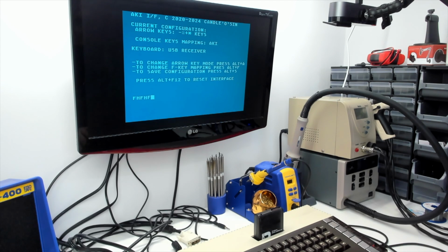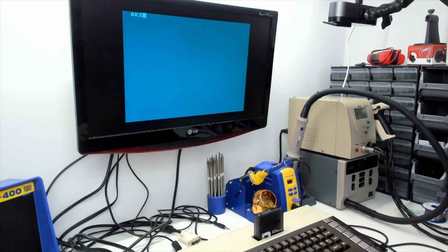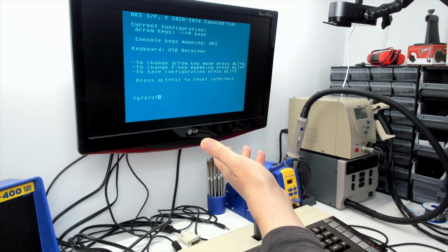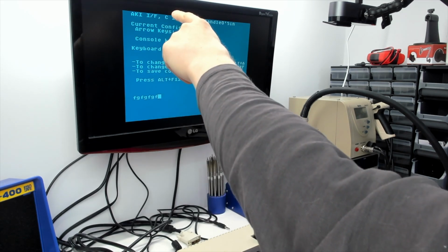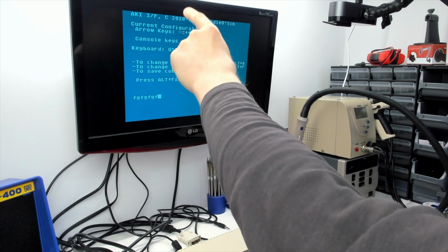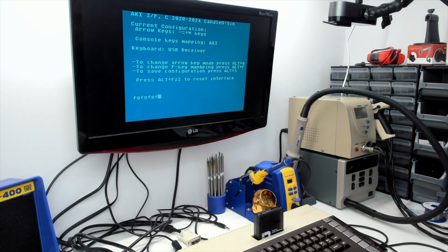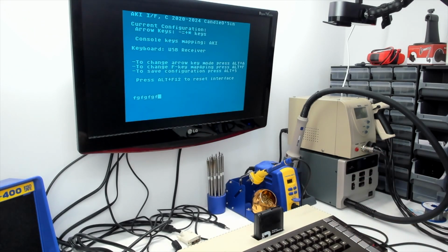So it's in uppercase, yes. And now if we press Alt and F1 again, right, and if we press break, is the keyboard in lower? Yeah, the keyboard's in lowercase. So yeah, I'm right. The first thing that this help screen does is issue the caps command to put the keyboard into lowercase, but it actually leaves it in lowercase, so that the next time you display the help screen, it actually puts the keyboard in uppercase.